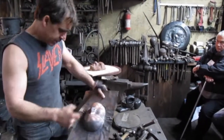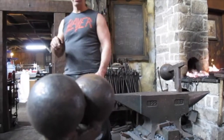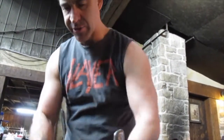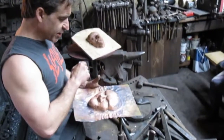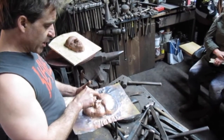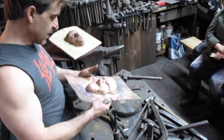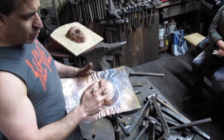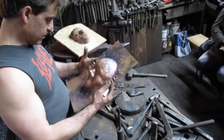That is a style of valley stake. Basically it's the shape I use to get tight contours of a double compound curve — it's being supported on two sides and you're able to work it into there. Everything that you do when you work on an area distorts the area adjacent to it. So as you're doing it, you refine one area, it distorts the other. You've got to go back and refine that, which distorts the other, in smaller and smaller circles until you get the shape that you want. It's kind of a bitch when you get an area that you really like and then working on the other part distorts it and you have to go back and fix it.